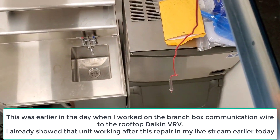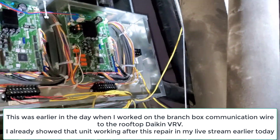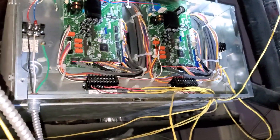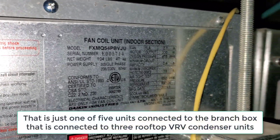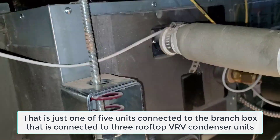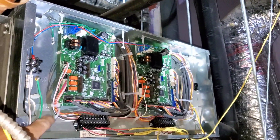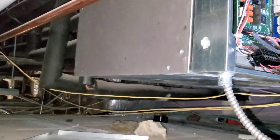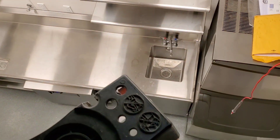Back at this place, up above a T-grid. I don't have my face mask on because I'm not going to sweat up here with a wet diaper over my mouth. Checking out the branch box — this is a completely variable speed unit. Here's a pancake-style unit, 54,000 BTU, so almost a five-ton unit. You can see how long it is — they're skinny, not very tall but long. They're basically like an LG or Mitsubishi, but it's Daikin's attempt. Here's their branch box, and all the ports and refrigerant lines over there you can never get to.